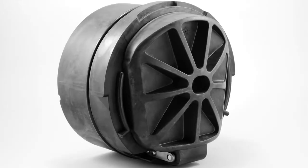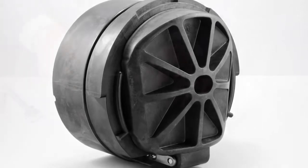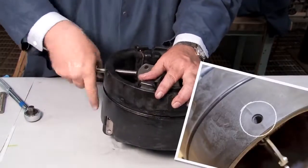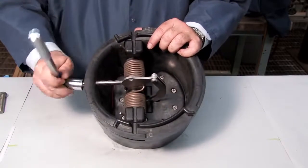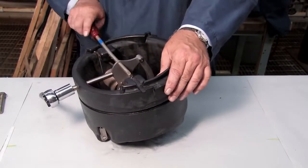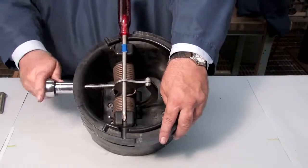To open and inspect the checks found in the 8 through 10 inch backflow prevention assemblies, you'll first need to thread a 1/2-13 by 5 hex bolt through the service hole located on the bottom of the check until it makes contact with the linkage. Continue threading the bolt until the hole in the cam aligns with the service notches on either side of the check. Place a number 4 Phillips head screwdriver through the cam arm and slowly unthread the hex bolt to transfer the check tension to the screwdriver.